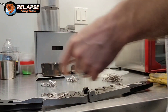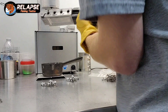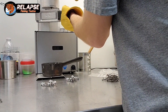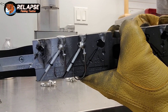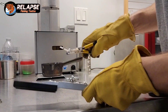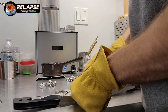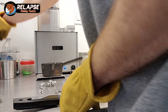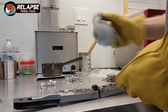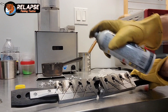Once you get the mold warm, what I do is spray that dry graphite right over my trash can in my little shop so any over-spray goes right into the trash bag. That one did not pour well either — actually poured worse. The hooks might need to warm up a little bit too. Since we weren't having that problem before and now we are, I'm going to just take my dry graphite. I usually do it over a trash can but I'll do it right here because I can always wash the bench off.